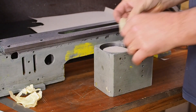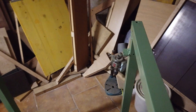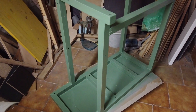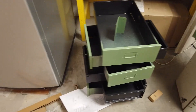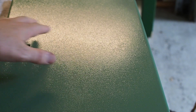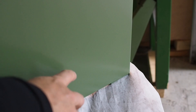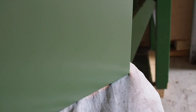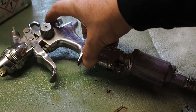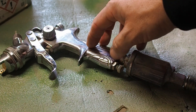As always with painting, it's the preparation that takes the longest. This is normally my wood shop but it's been misused for painting. Probably not ideal because there's quite a bit of dust around, but I gave it a good vacuum before I started. Once this is dried I'll flip it over and do all the top sides. Here are all the drawers — I only painted the fronts of those. The control panel has a heavy orange peel texture from the powder coating, and I kind of wanted the same texture over everything. To get that orange peel effect I turn the air right down and the paint right up, which makes it splatter. The only problem is it then takes quite a long time for the paint to cover everywhere, and by the time it has full coverage it's a really thick layer that takes ages to dry.